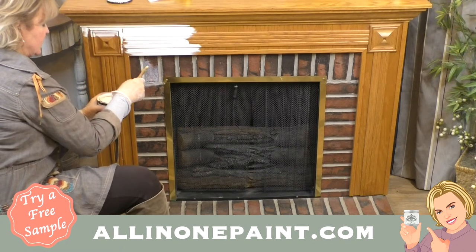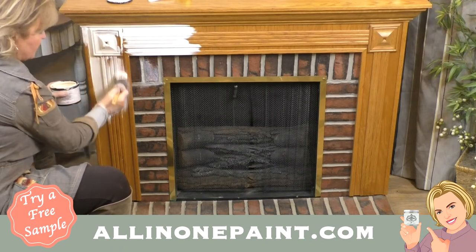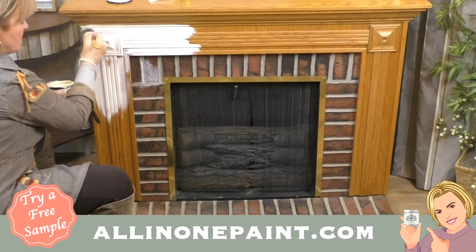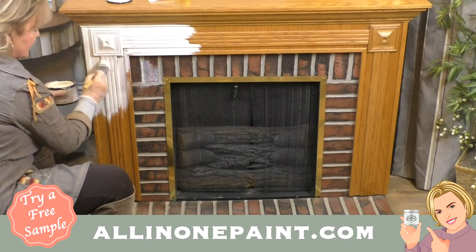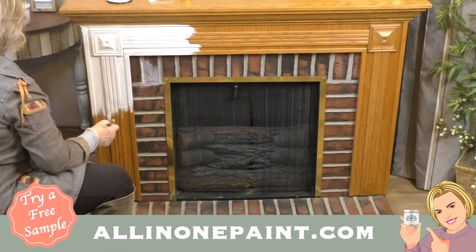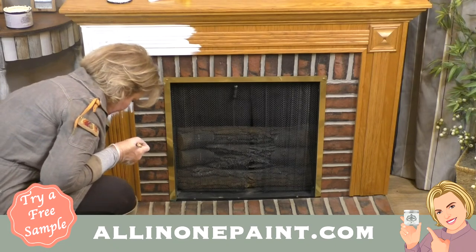All the rest of this is going to get done in the gel stain — our walnut wood gel stain. I'll show you how that works in just a moment. I'm going to roll back through using our little roller to show you the brush and roll technique. You can also use the true applicator if you want to stipple. I already made a little drip — let's go ahead and wipe it off.